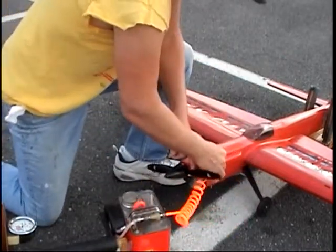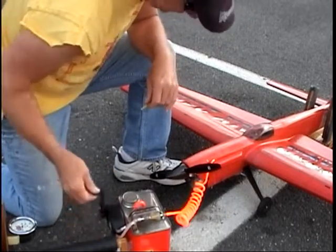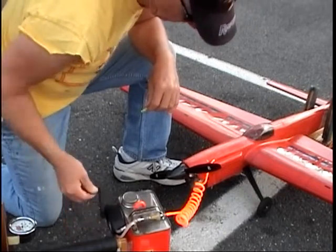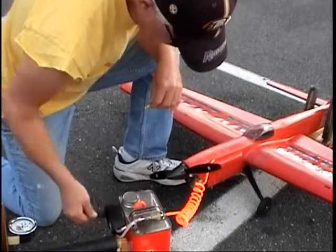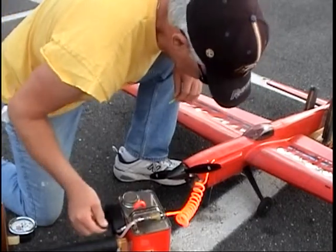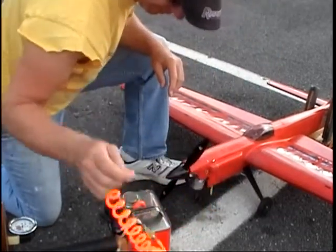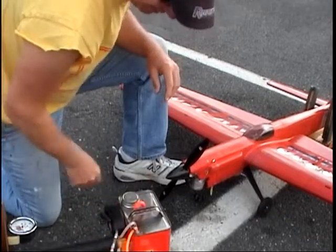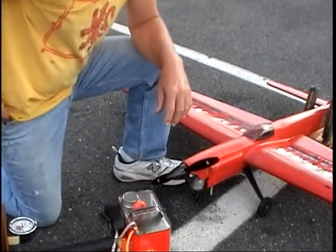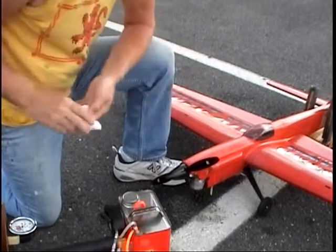And it's starting to look like it runs better just on an open vent. But as we keep tuning, obviously that may change. And it's interesting how some motors are very sensitive to that and some motors are not sensitive at all. But you can notice in the way the motor brakes, it sounds a lot more like a traditional stunt motor when it's not on that pressure, and it has a much more locked in sound when it's on muffler pressure.